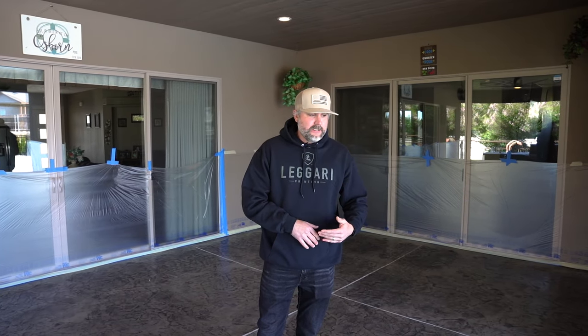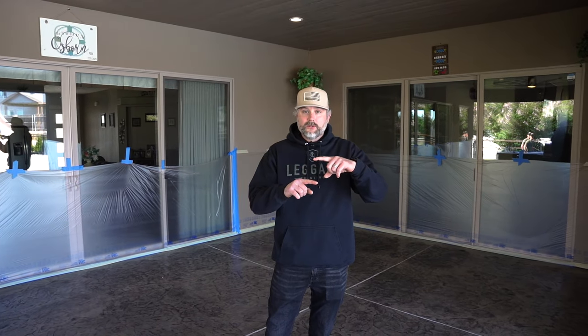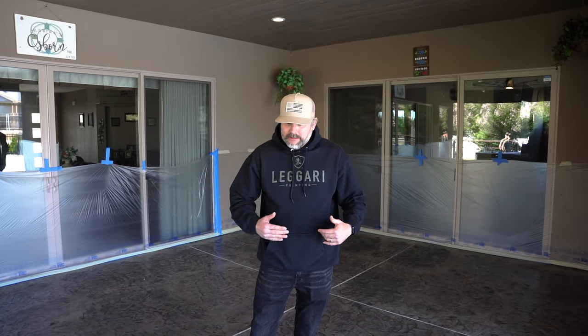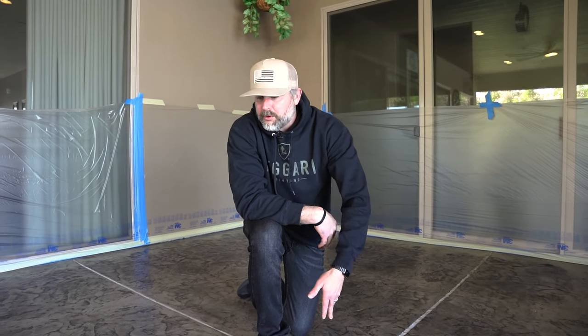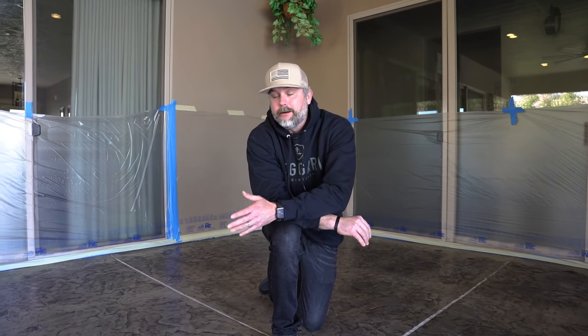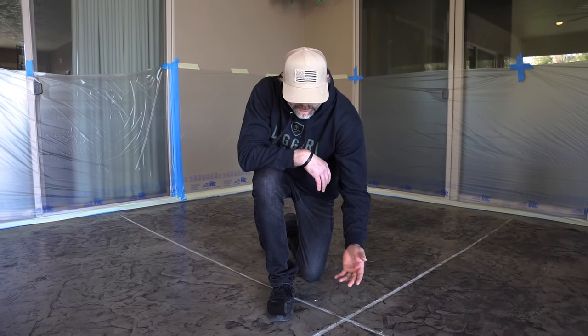The prep work for this, if you're doing the prep replacement, you want to clean it, maybe run a degreaser and scrubber, get it as clean as you can, and remove all the contaminations. And again, just take your time. If you're using a pressure washer wand, you want to hold it really close to the concrete. Again, clean this as good as you can. They should have done a brown polyurethane caulking or something in here to match it. So what we're going to do is tape this off with our filament tape, and we'll show you that when we do it.